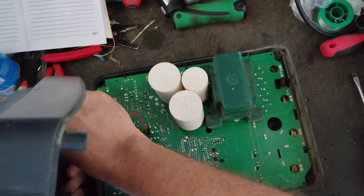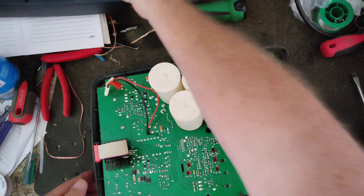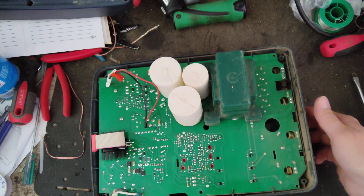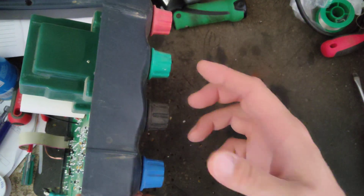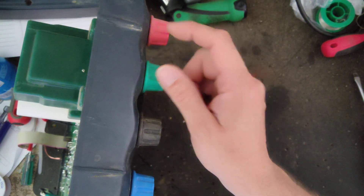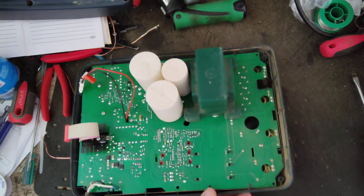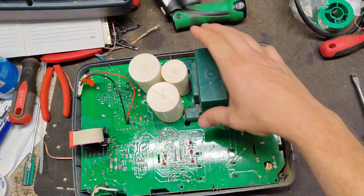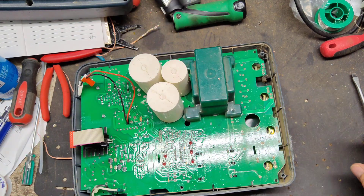I started to take this apart before I started making the video but didn't get very far. This is about as far as I got. The two terminals that are hot and ground — it's got four terminals, a black and blue for your fence alarm and ground alarm, and ground reference and fence reference voltage terminals. Maybe the transformer has an internal short, because that's what spikes the voltage up, and an internal short would drag it down and cause issues.